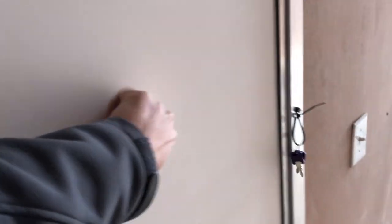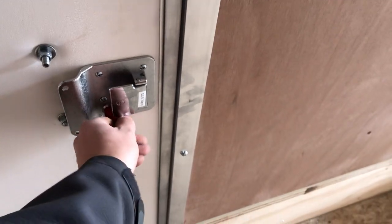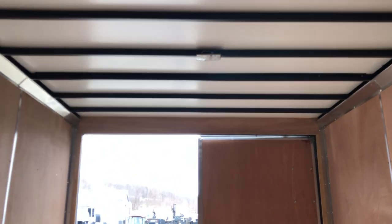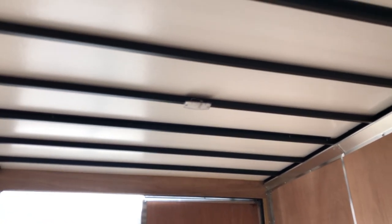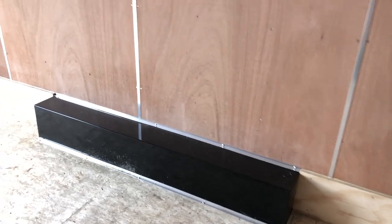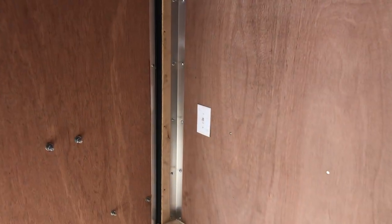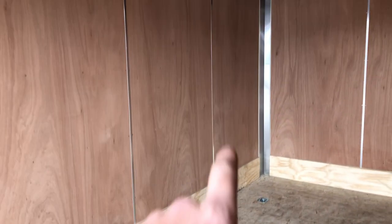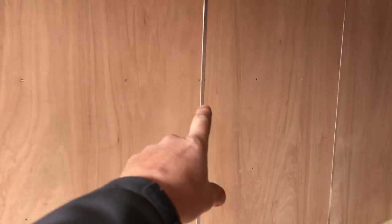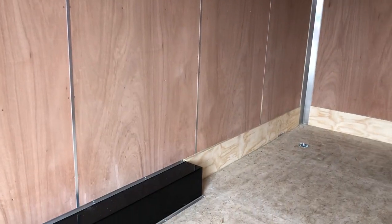The RV-style door has a little step wall inside. It's a solid door — you've got your keys, you can lock it from the inside or the outside, you've got your deadbolt and your handle lock. You've got residential-style switching. The dome lights are about a third of the way from the front and rear, and there's a rear switch. In the walls, you've got an X pattern just like underneath, and then in the corners you've got a 9x16 gusset. On each of the vertical wall posts — which are 16-inch on center, so between every 4-foot sheet — you've got two gussets on each wall post as well.